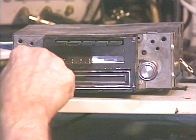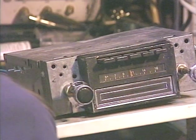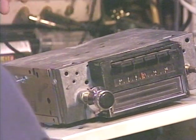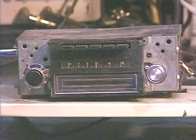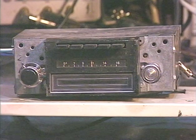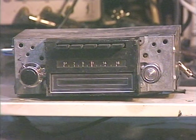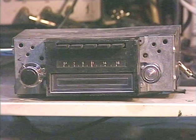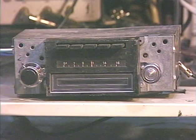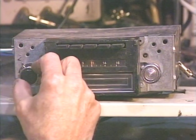I'm going to turn it back to FM. Let's go ahead and test the aux input. I'm just going to feed a quick tone into the aux jacks — there's the right side, there's the left side aux. Now after using the aux input, after the signal is removed, it does take 20 seconds for the radio to come back on. That's because of a VOX circuit — a voice-operated switch that holds on to the aux signal a little longer, just to make sure we're not constantly switching back and forth between songs and during quiet music passages. If you don't like the delay, just turn the unit off and right back on and the radio will come back on immediately. And there's the radio coming back on by itself.